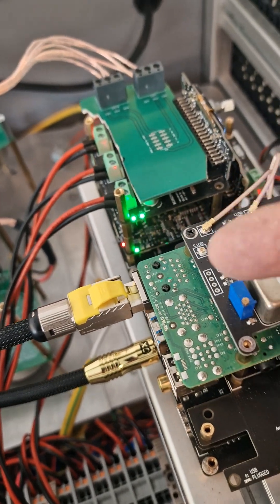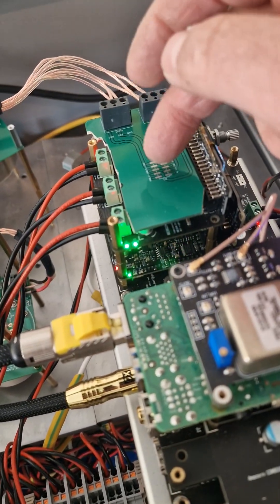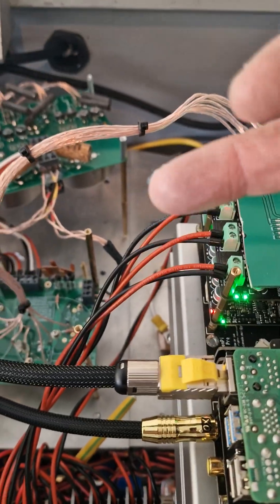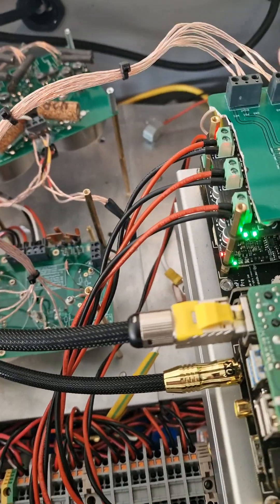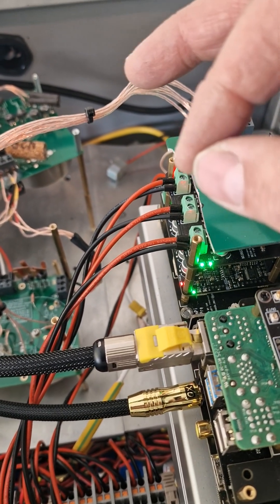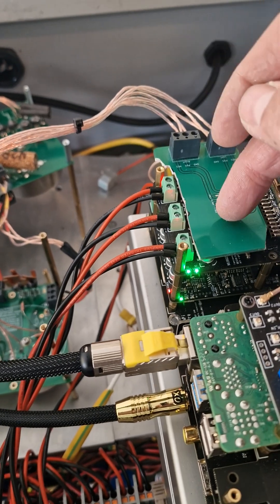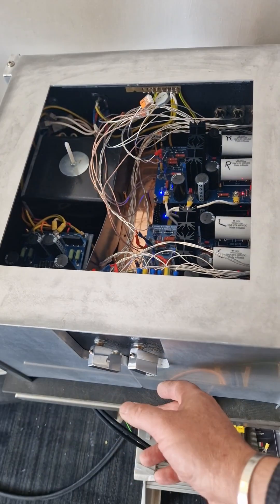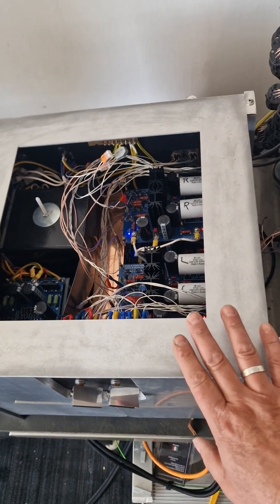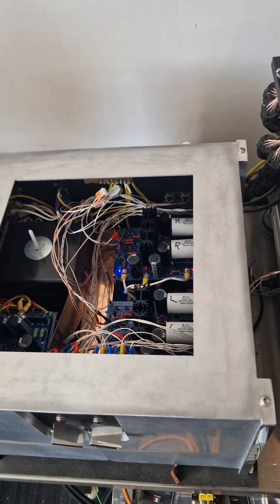If you're planning to build something like this — 1-to-29 — 13 ohms on the primary works well, or 7 ohms, and in this case right now it's seeing 5 ohms per channel. That's a really good setup for this deck. It's feeding into this Boz preamp here, which I bought the boards from Gareth and he assisted me to build.